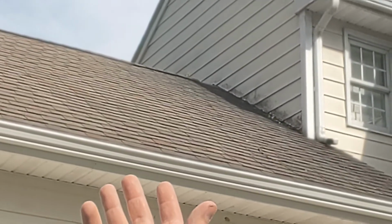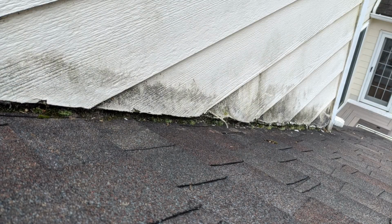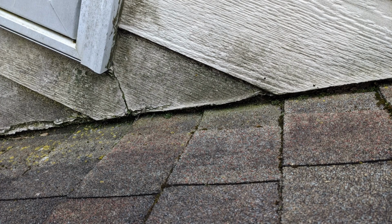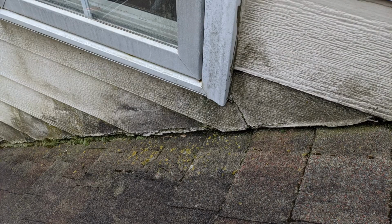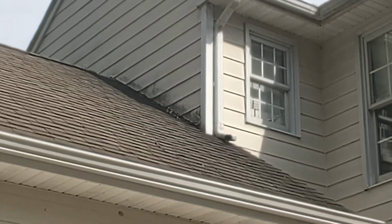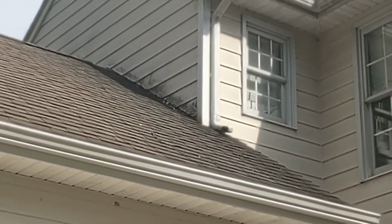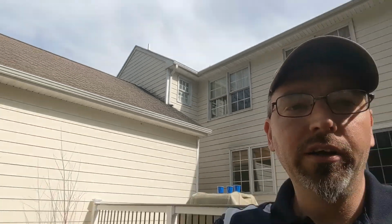Give you a zoomed in shot here at the top of the roof line, so you can really see how that's starting to just fall apart. So we really want to get that off of that end, and we'll get, like I said, 2 inches of Hardie trim or some capped aluminum over some wood down over the step flash, whatever set up there, and that'll solve that problem. And then if the roof ever gets replaced at some point in the future, whoever's doing the roofing can use what we put in there and actually run their step flash potentially right against that, which should make their lives a little bit easier. So part 1 here in Kennett, Pennsylvania.